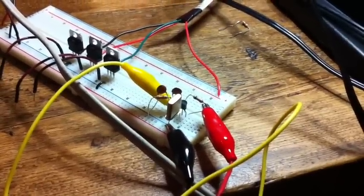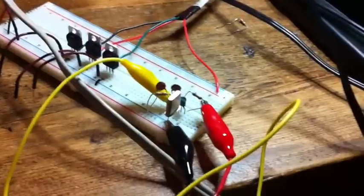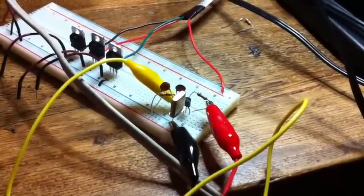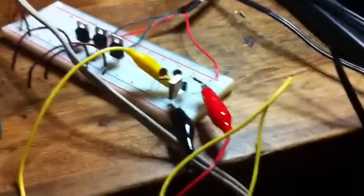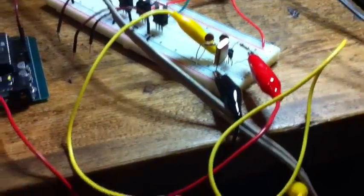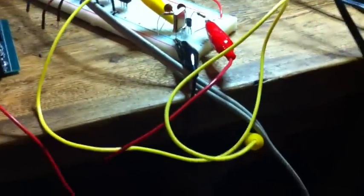These are really just bench scrapings. If you have any electronic stuff at all, you may not have the crystals lying around, but you can use crystals of almost any frequency. These happen to be 3.68 MHz crystals. There's almost no antenna on this — it's probably illegal to use it with a large antenna. I'm just using a clip lead basically, also sending it to my oscilloscope so that I can see the waveform.